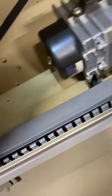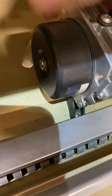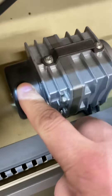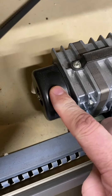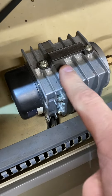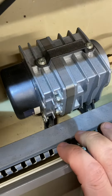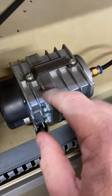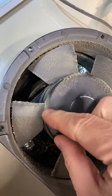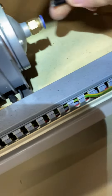The reason I did that is because after about a week of running, it's pulling all of the fumes out of the inside of the machine into your air assist pump right here. What it does is it clogs up the filter, and before too long it'll clog up the pump — the piston on the inside of the pump will get gummed up.